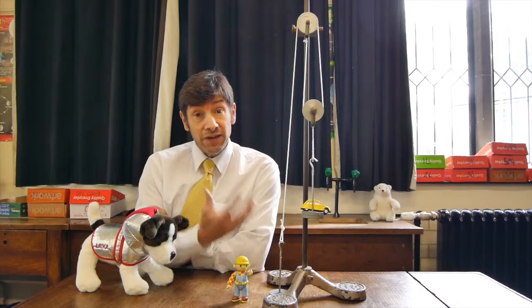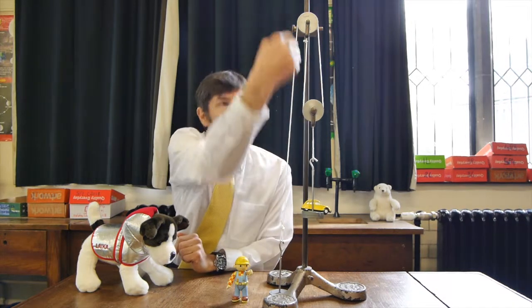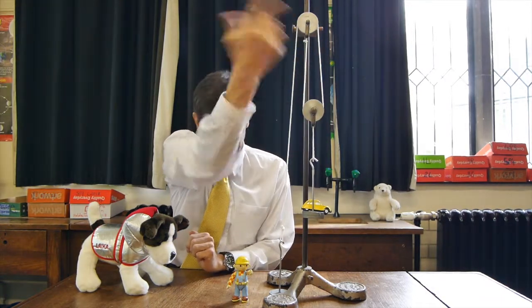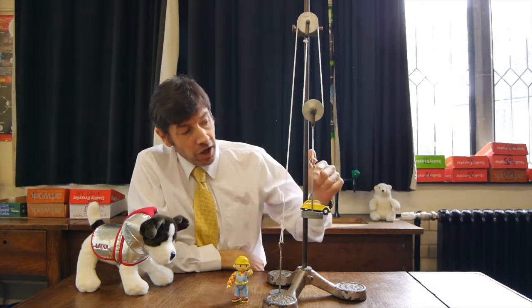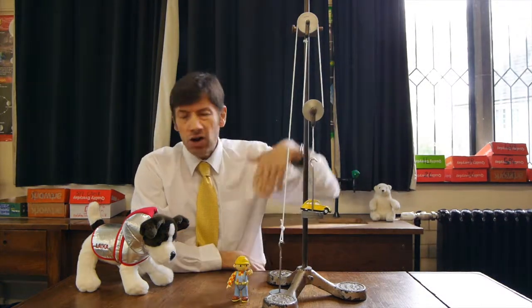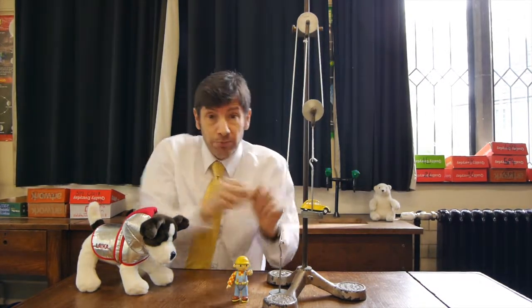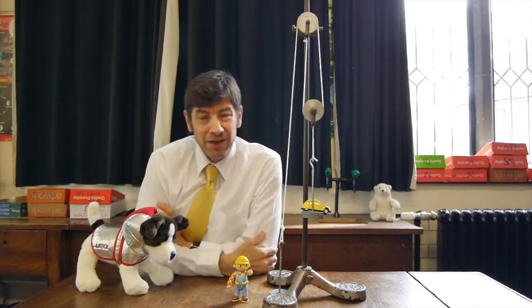You can make it even easier to lift heavy loads by using more pulleys or more ropes going round and round. You can have two pulleys on each side — four ropes — and so on. But there is a limit: you're not only lifting the load, but also lifting the pulley, all the rope, and overcoming friction. You can't multiply indefinitely; if you did, you'd have to pull in so much rope you'd disappear miles away, which wouldn't be a very practical system.